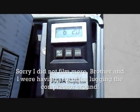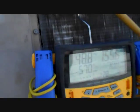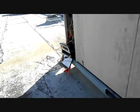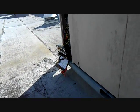We're charging the unit up to six pounds eight ounces — we have six ounces to go. Everything's running smoothly here at 50 degrees, and we're annoying everybody eating at McDonald's right now. But we're almost done — the unit is running and we're about to be done and shut everything down so they can have electric heat again.